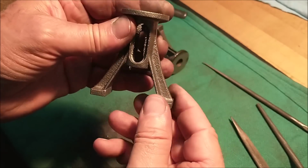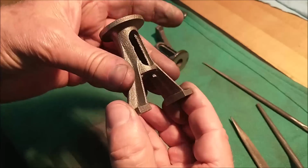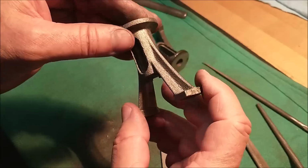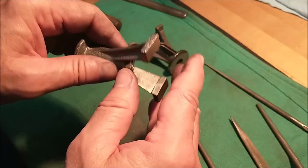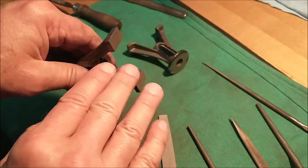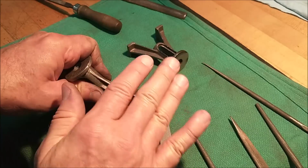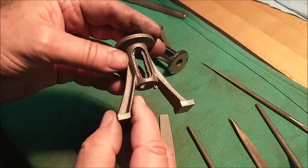Well, I think for the most part, you get the idea of how much work it actually takes to do this. This is compressed footage, of course, but you're looking at about a half an hour worth of nonstop filing. And the reason I'm bouncing back and forth in between parts is because when you find a nesting position that you like, stick with it. Do both parts and come back and then find another position for something else you like, the right combination of files, and have at it.